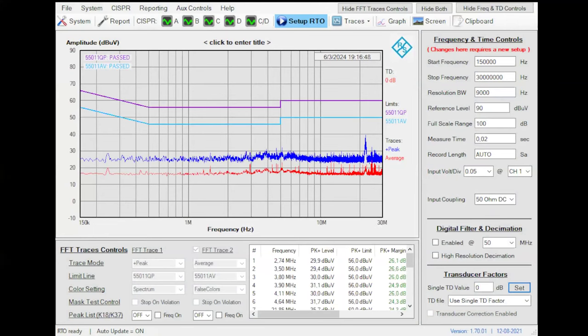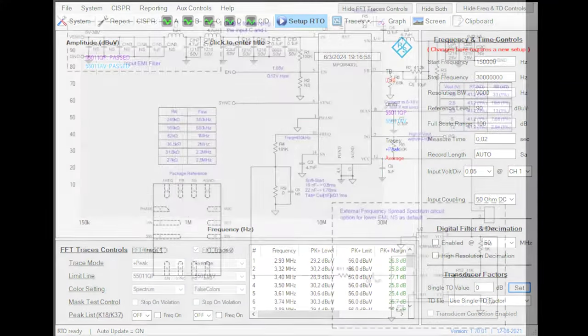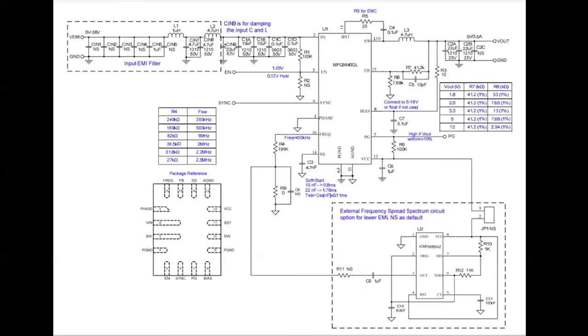Okay. So I would like to explain. I am interested in these suggestions because for all of you interested in designing low impedance, low emission circuits, it's very important to understand some of these techniques. This is for a buck converter, but you can understand this for any switching topology. What are the two most important elements in a switching device? In a switching circuit, the most important thing is the switching node. Remember, this is where you are creating harmonics and usually ringings. This is a high dV/dt node. It's a strong electric field area and is connected to the inductor.